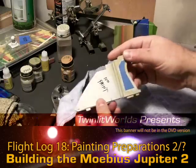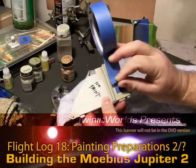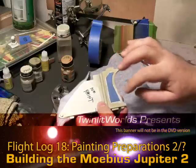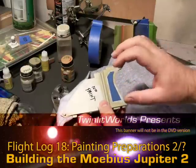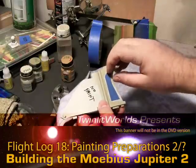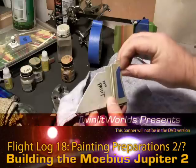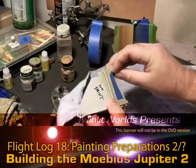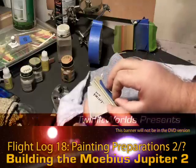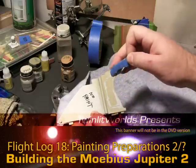I didn't think much of scraping at first because it's going to be painted over anyway. But on this side I put the tape down over the entire piece, rubbed my thumbnail into it, took the razor blade, sliced along the edges, and then pulled away — and all the rest of the paint pulled away as well. I'm thinking 24 hours was not enough for it to fully set. Chances are when I pull this tape I'm just going to pull the paint color again, so I'm going to repaint this entire piece.